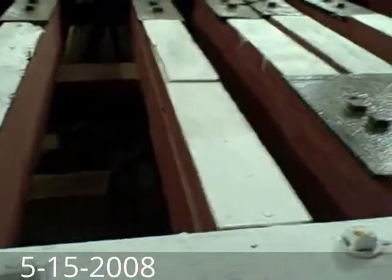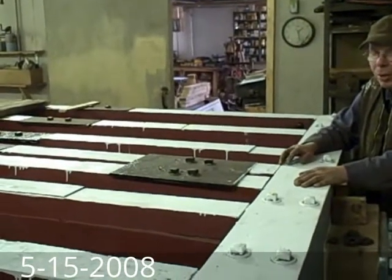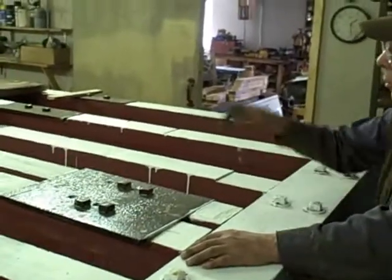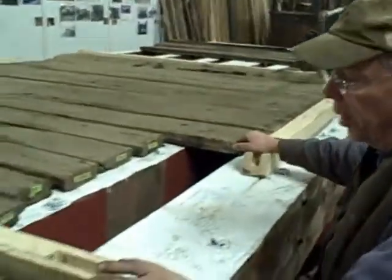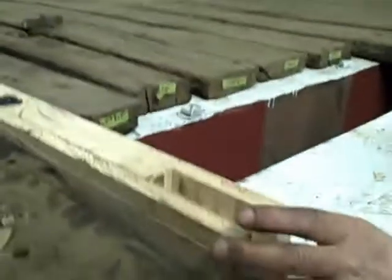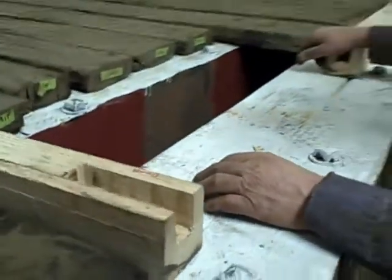The car is now lowered down. We had it way up a foot higher and then lowered it down because the next step is going to be to work on the deck. Being not quite so tall, I had to find it convenient — we lowered the deck down approximately a foot, getting down as low as we had horses that would go underneath to hold it, so that it's now convenient to work on the deck. Now let's look at the deck itself. The first thing we had to do was make sure we had the cab sills in place. These are ash, approximately three inches square — white ash — which is what the originals were made of. They go around forming the exact frame of the cab. We measured many times, and there were old holes in the sill which made it possible to locate these things pretty close to where the originals were.